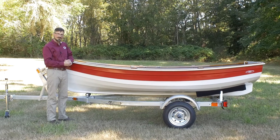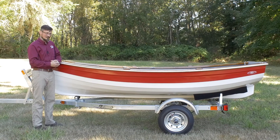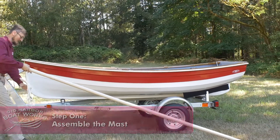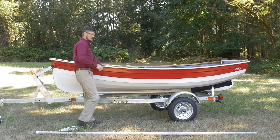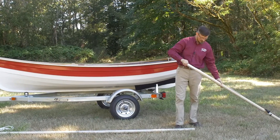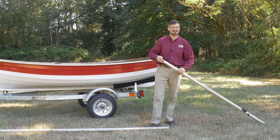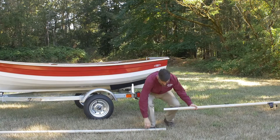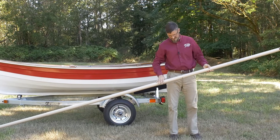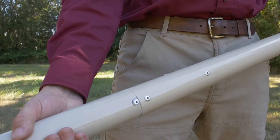All your gear is in the boat as though you had just arrived. The first thing you need to do is pull out and assemble your mast. The mast comes in two sections — you have the upper piece and the lower piece. The two slide together; it's just a very simple slip fit. The only trick is to make sure your joint is clean. If you have any sand in the joint when you slam it together, you might get it together but chances are you won't get it apart again. The tolerances are very tight. Just line these up, make sure they're straight, and they'll slide one into the other. There's a little keyhole to make sure you get them together in the right direction — there's really no way to do it wrong. Just click and you're done.